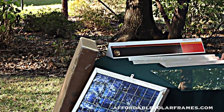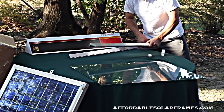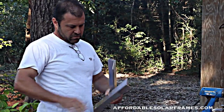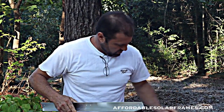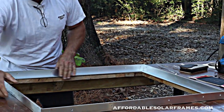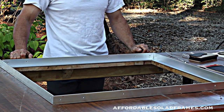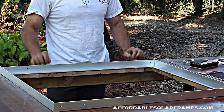I'm going to show you all how to assemble this thing, starting with the frame, and we'll go right through soldering and a complete panel. When you assemble your frame, you don't want to bolt it together first — you want to just lay your pieces like they would go. I have a hole in my table. It just makes it so much easier to lower the glass in and see what you're doing when you're soldering and encapsulating.